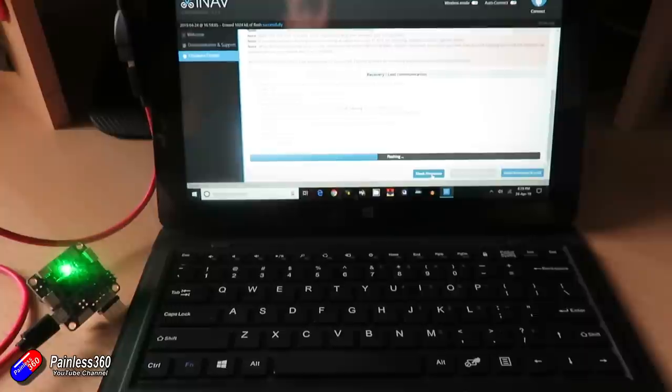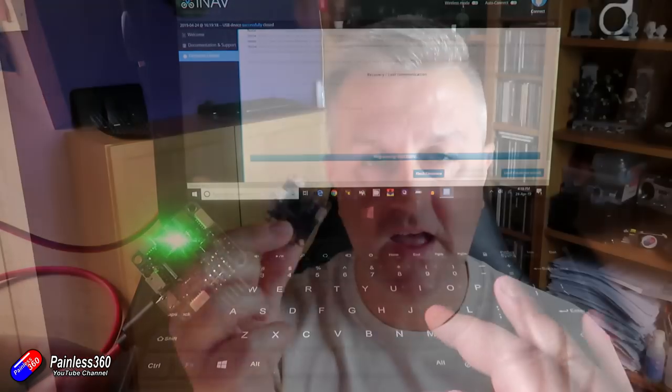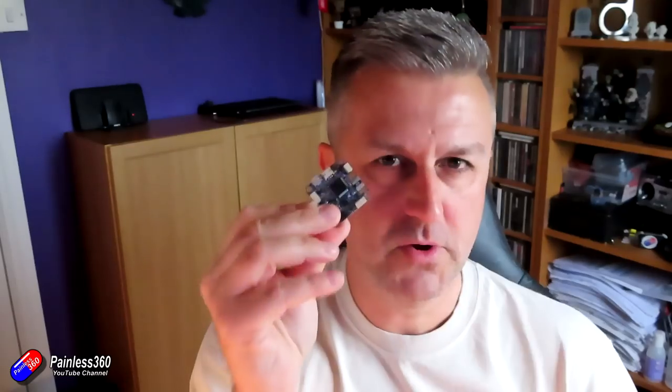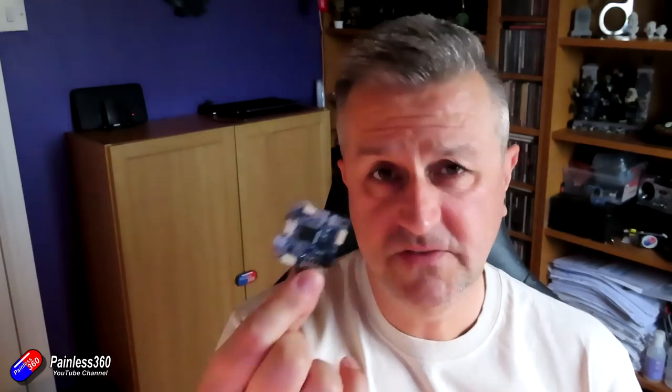It'll start flashing and it takes a little bit longer to flash than most Betaflight or iNav boards, so just sit with it — it'll take probably a couple of minutes. Now, because it's got the bootloader installed, if we wanted to, we could load custom firmware inside Mission Planner and reflash another version of the Ardupilot code. Or you can flash the new version with the underscore bl.hex ending using iNav or Betaflight — you just have to press and hold the DFU button. For those who ask: once you've done this to a board, you can very easily get back to Betaflight or iNav. Just press and hold to boot it into the bootloader, plug it into iNav or Betaflight, and flash it as normal.